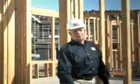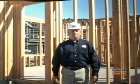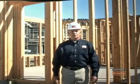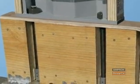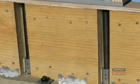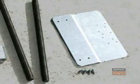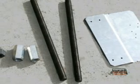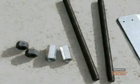The final installation to be demonstrated in this video is that of the first-story wall on a wood floor system. Note that this installation is similar to the upper wall of a 2-story stacked installation. The basic components involved in this installation are the standard steel strong wall and the connection kit for the first floor on a wood floor system application, which includes the following contents: 1 shear transfer plate sized for the specific wall with number 14 by 3/4 self-drilling screws, 2 18-inch threaded rods, 2 coupler nuts, and 2 heavy hex nuts.